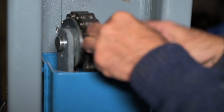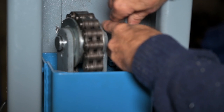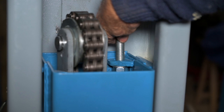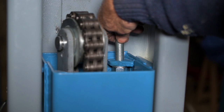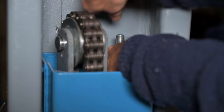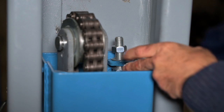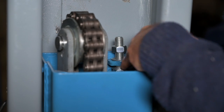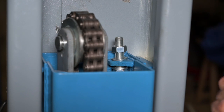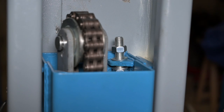Take a washer over the cable and try to feed it through the hole in the back of the shuttle. Put a washer and a nut — so a nut in the bottom, a washer, a washer, and a nut — and that way we can adjust the cable tension later on. Right now we will install the second cable.